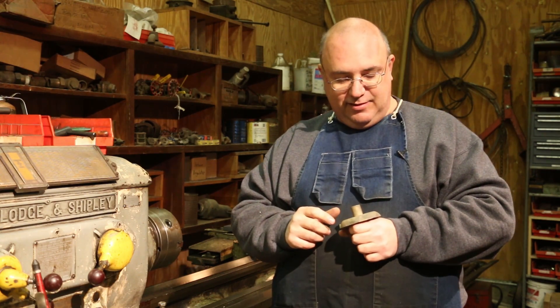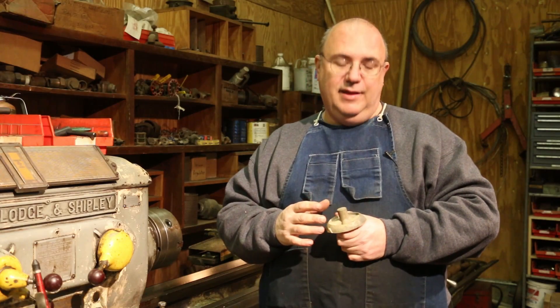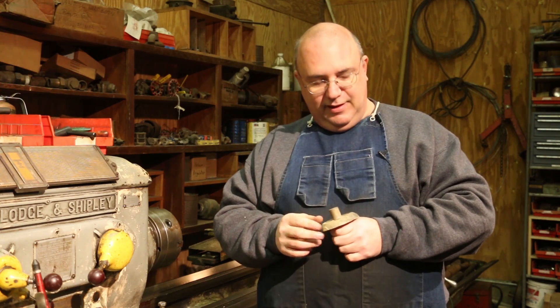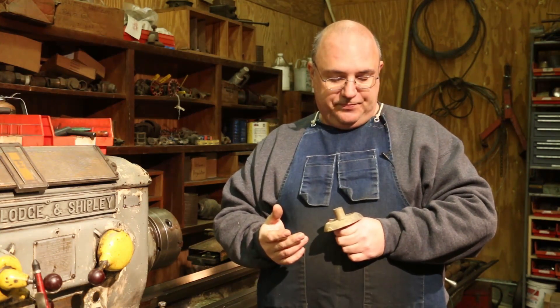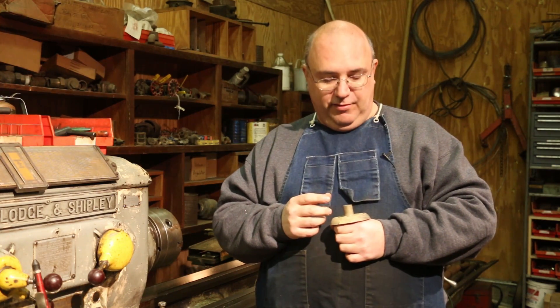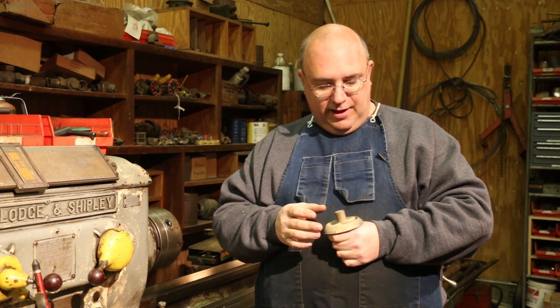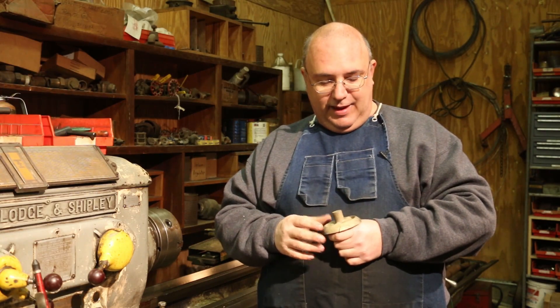We're going to have to go back and recast these. Based on some feedback from previous videos about the inclusions, a lot of people asked about why not braze or TIG the voids up and then go back and re-machine it. I considered that, but I decided not to go that route. Number one, this is brass, and usually when you're brazing or TIGing, you're using a bronze material, and I didn't think the color would match. Secondly, when you heat it up with TIG, a lot of times you'll actually burn the zinc out of the casting, and that can cause some issues as well.